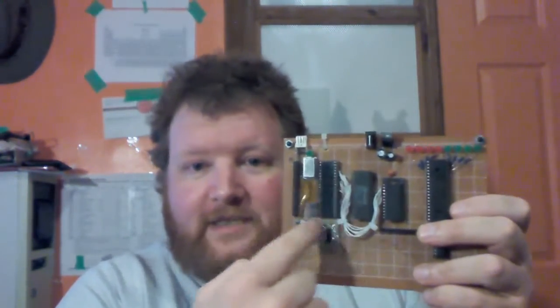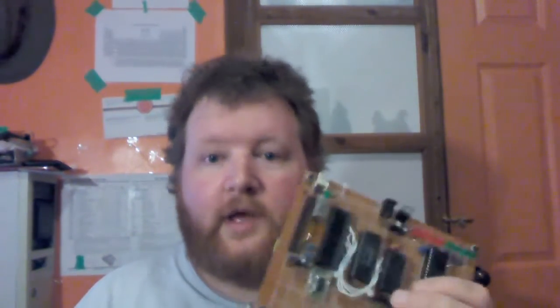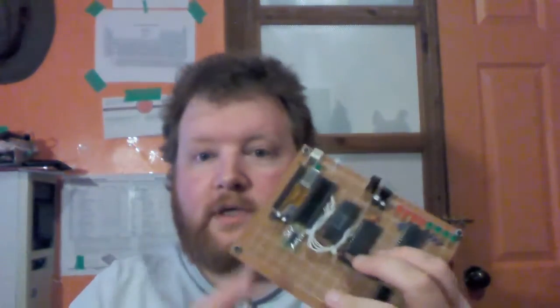As I mentioned, the next video will be moving to a prototyping board, hopefully tidier. I'll be replicating the clock and reset circuitry with expansion. Then we'll hopefully work on our first ROM — I might use a flash for convenience or an EPROM, though that means waiting 20 minutes between programming sessions to erase it. I'll probably do the flash. We'll also do some memory decoding as well.